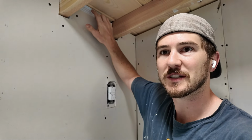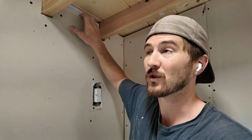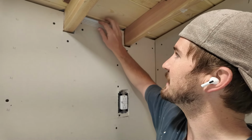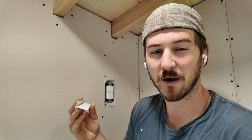I found a bunch of different DIY articles and professional articles that recommended this specifically for drywall to wooden exposed beams to make it have that nice clean look. So what you'll do is you'll use a spray adhesive. There's a very specific one that they make for this that's, I guess, for probably vinyl plastic. They literally don't sell it in California, and it doesn't feel like you specifically need that. What you really need is just anything that is a multi-purpose spray adhesive that can stick with plastics and other materials. So I just bought the regular 3M77 spray.